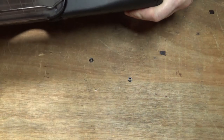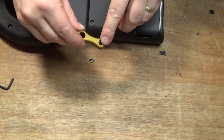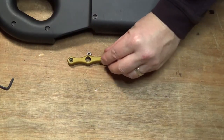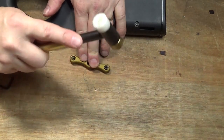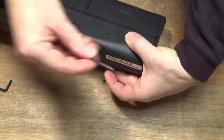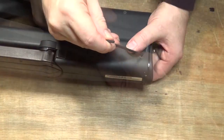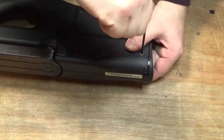We're going to set the two shorter screws aside and use the longer provided screws. Now these nuts will be just a little bit too big to go into the holes provided here — Jay tells me that's intentional, so that when you press them in you create a little captured flat. We want to just get them started by tapping them in with a non-marring hammer, just enough to get them started, and then use the provided longer screws. The act of screwing it in will draw those nuts in, and you can feel when they've drawn all the way in and bottomed out.